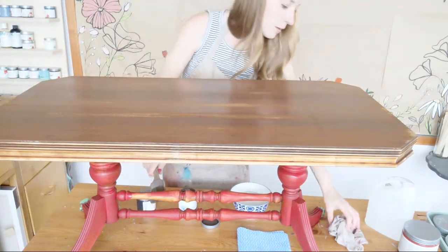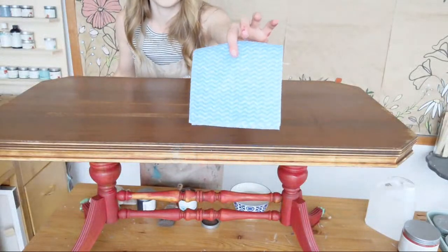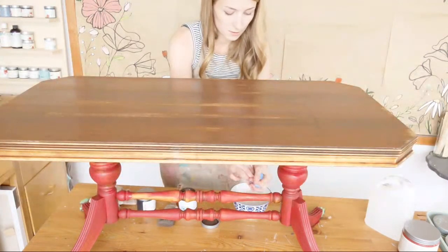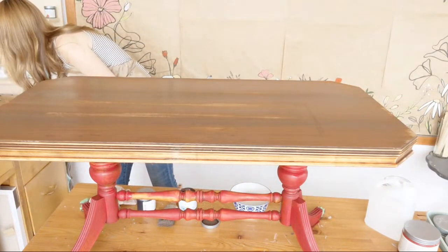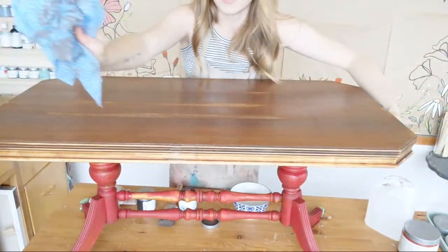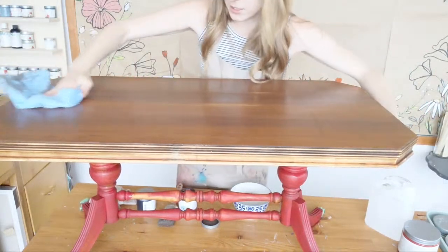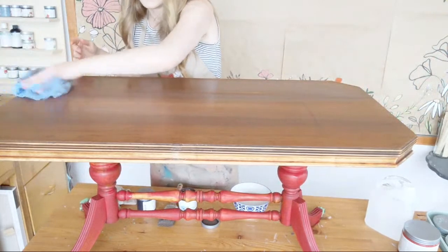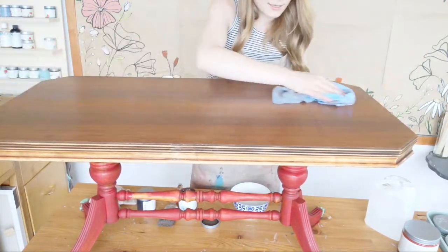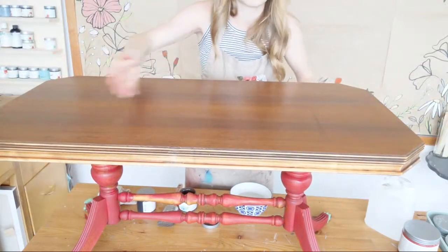You want a lint-free cloth — unlike the rag I was using, I want one of these lint-free dishwashing cloths, and I've got my cup of water here. It comes off without wasting a lot — a little glaze goes a long way. I want the top to match the bottom, using glazes with the same tone I'll use over the painted piece. Glaze just leaves such a nice finish. It's wet now but will dry differently in a moment — don't put anything else on top or you'll just keep rubbing it off.